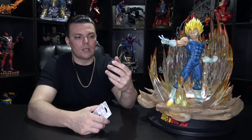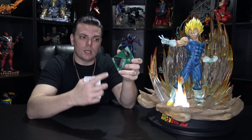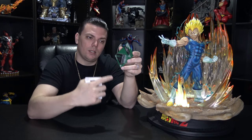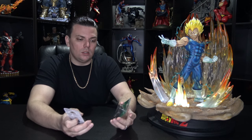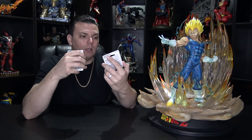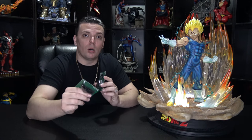I've seen a lot of collectors use bigger corner brackets, maybe three or four times the size of these. They also have a metal bar that goes from corner to corner of the bracket. You really don't need that. To eliminate some shelf sag, you can use a piece of metal that goes from this bracket to this bracket and spans all the way across the bottom of the shelf — that remedies bowing, while the corner brace itself remedies the shelf from falling.